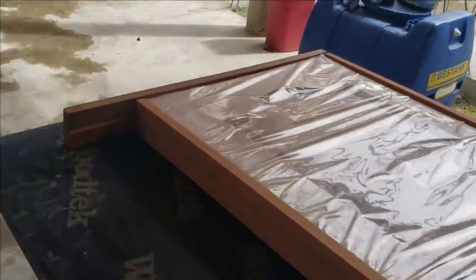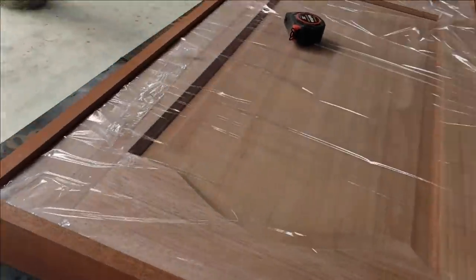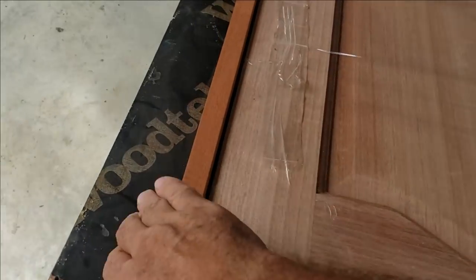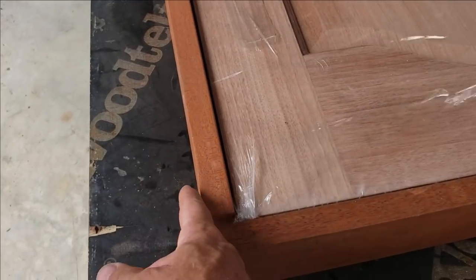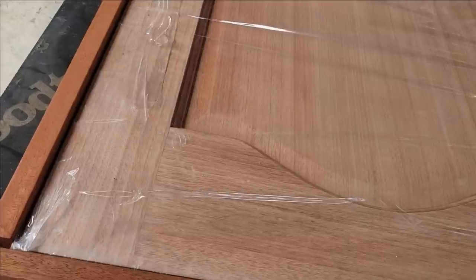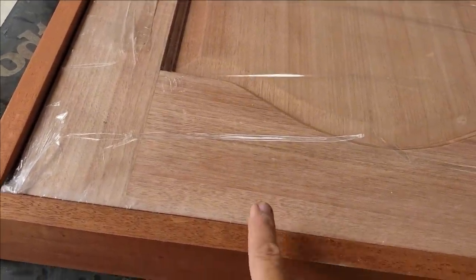I know you all see me setting this up and thinking, what in the heck is he doing? That ain't how you do a door jamb and all that. All I'm trying to do is, because we're casting these walls in place, I need an exact opening or a little bit of play, because you might get it a little off. You need some adjustment. So I'll probably go maybe a quarter inch play on each side or something, and get an opening made that'll fit this door.